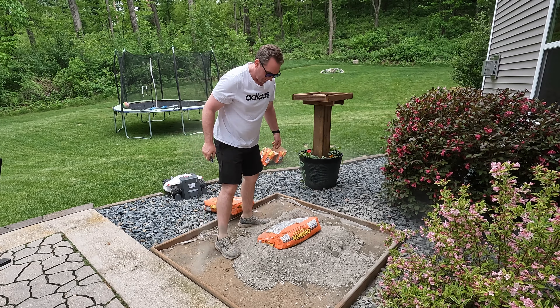Now I was finally ready to put some water on the slab. I have a standard garden hose attachment with a mist setting and used that first. The idea is you're not using any powerful droplets or jets of water that are going to move the powder or mix around. We spent so much time trying to get it in the right shape that if we blasted it with too much water it would dig a hole in it, so I just gently misted it to start. Round two of misting — it looked like rain was on the way, so I got the kids' slip-and-slide out and covered the slab with that to prevent any big rain droplets from wrecking the surface.